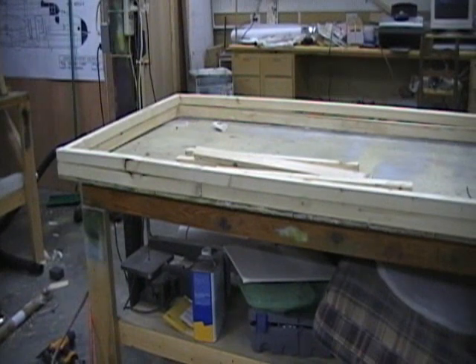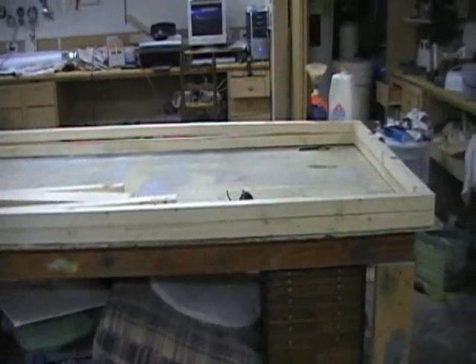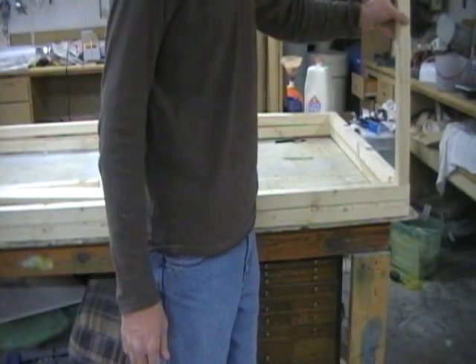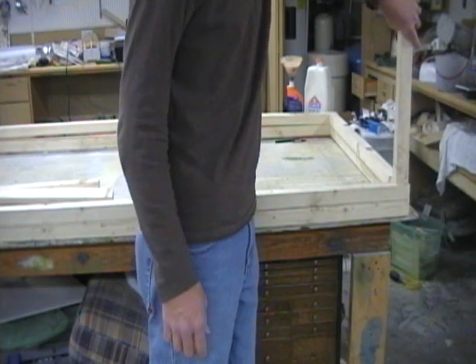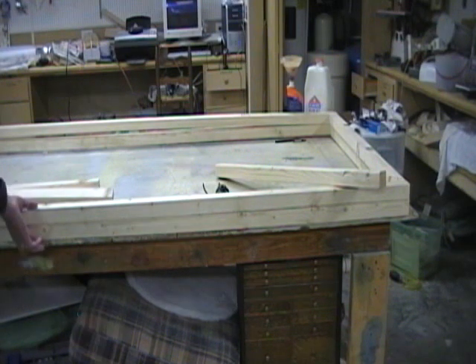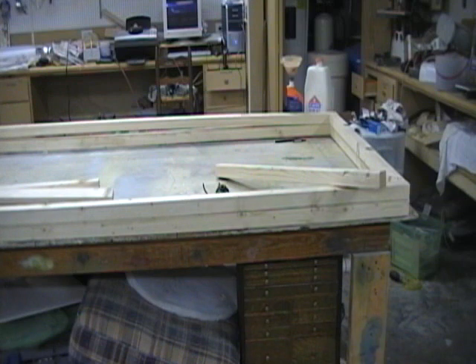I've got two mirror images made — two of the exact same size. I'm going to take the bottom one and mount four corner posts on it using glue and nail brads, with the posts sticking up. Then we'll add the top frame to it. You can cut all these pieces at one time. You have to take into consideration the 34-inch height and the thickness of the frames when cutting your corner posts.